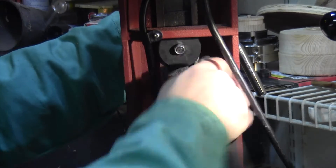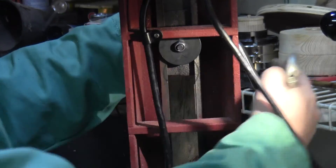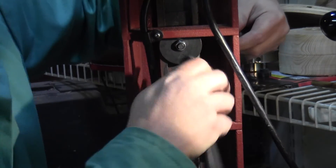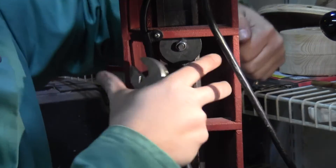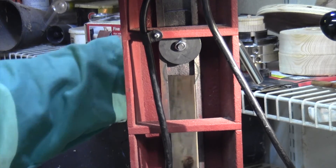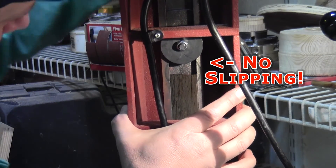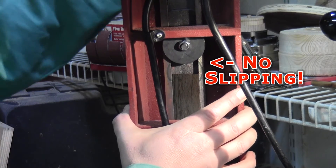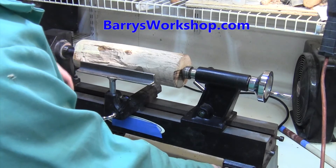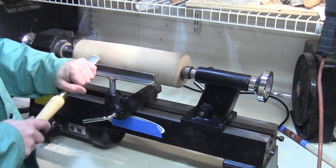It takes a little bit of trial and error to get the nut in just the right position so that the tailstock locks down consistently, but once you set it, it stays in place. And with the tailstock locked down, I'll go ahead and repeat the test to see if the lock plate is not moving — and it seems to be holding in place. With the new lock plate in place, I'll just do a quick turning to make sure everything's working as it should. And it looks like I'm back in business.